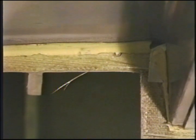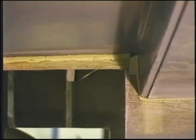But it'll be flush only up to the bottom of this cutout. We'll extend the line out here this way on both sides and cut straight up, straight over, and straight down, flush with the bottom of the strake. We're going to run plies of glass from this face around the edge, this face around the edge, and from here up and around the underside.